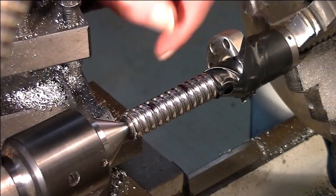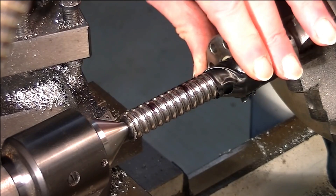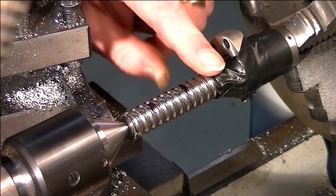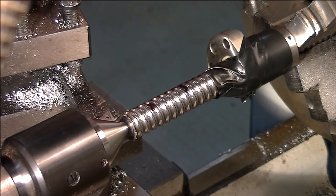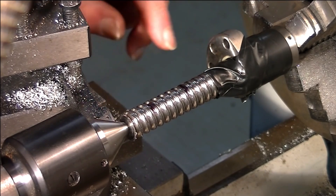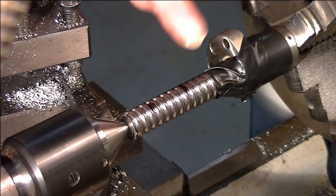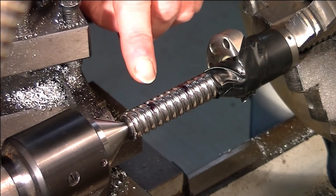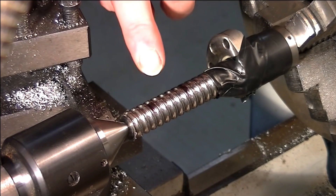I've got some electrical insulation tape — it's very tough — just on here and onto here, because it's a bit of a pain trying to get this off the screw. You can do it and I'll demonstrate afterwards how it's done, but in this particular case it's quick for me to just put a bit of tape on here to make sure no shavings get into the ball screw. I've already cut this off with the angle grinder as you saw just now.